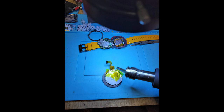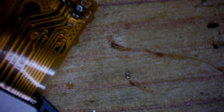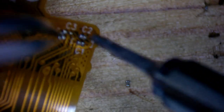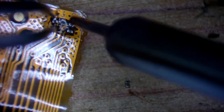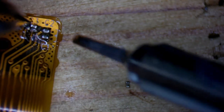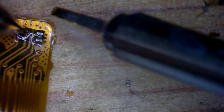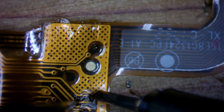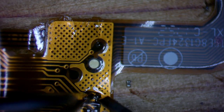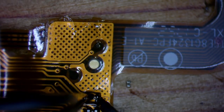You will see the second part — soldering a new capacitor back in its place. For this repair you will definitely need a microscope, as these capacitors are very very small — 0.8 by 1.6 millimeters. You will also need a very small tip soldering iron so as not to damage any other ribbon cable. In principle, I exchanged the C3 capacitor with a one microfarad value capacitor, as the previous one on the circuit showed 0.8 microfarad. I'm still thinking that maybe even a higher value could be good, as when I had the contrast on 100% it still wasn't quite the same as before — so this may be a future update.